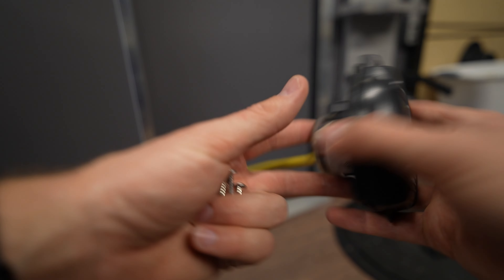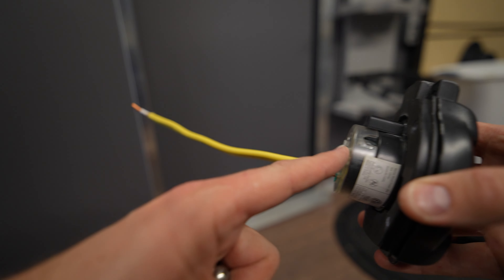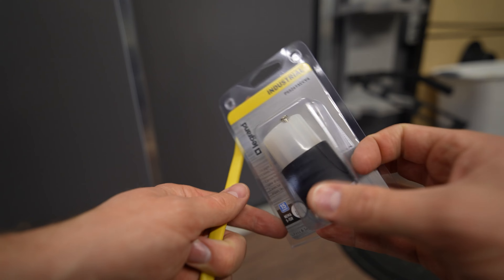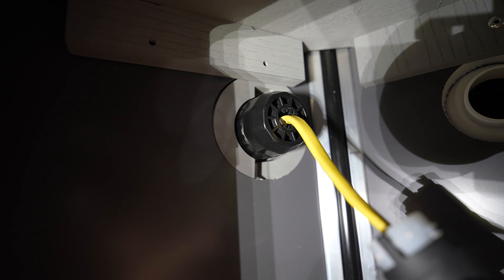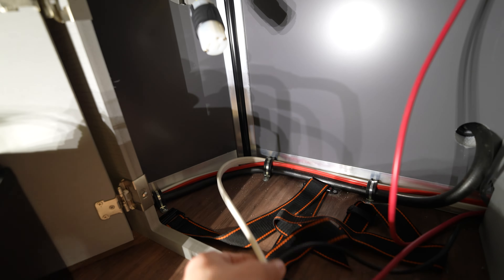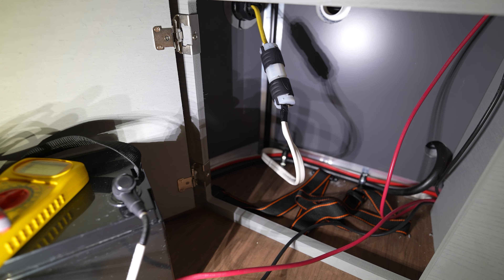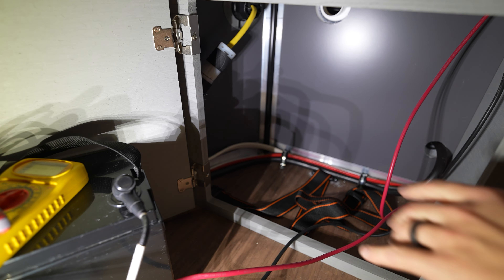So as you can see, this is the shore power plug for outside. I wired up some wire coming out of the back of it. This will go back in outside — I'm going to go screw this in right now. Then this will come inside, a clip will go over the back of it, and we've got our wires here that terminate into a female outlet connection. Then we'll be able to plug everything in directly. Here it is — the shroud's back on, the port outside is hooked up. We've got our little short yellow cord with the wire hooked up to our female plug end, and we've got the white wire which is our house power. So now we should just be able to plug this in and be back on shore power. Let's try it out. Boom — you could probably hear the microwave just started up. Awesome, that's great news. And we're on shore power.